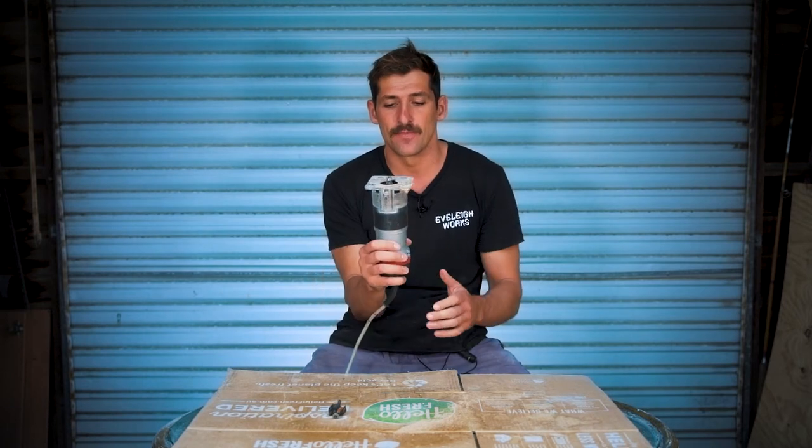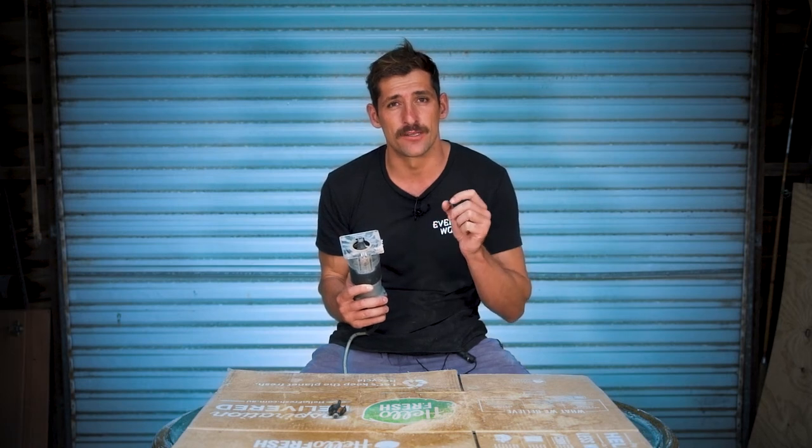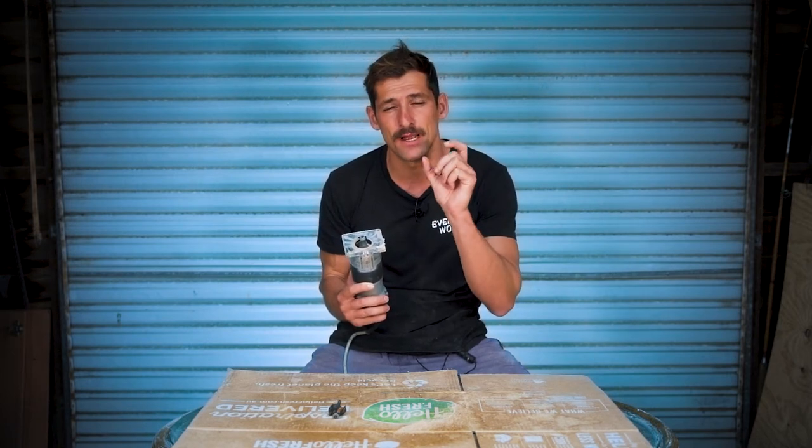If you really want to be safe, you can take multiple passes — set it up, take a small trim, and then incrementally go around your speaker. That's a really great way to do it, because you're going to mitigate the risk of taking big gouges in your timber or making chips. Sometimes if you're working with a real hardwood or something prone to splitting, you want to take some real small cuts — lots of them — just to mitigate that risk.